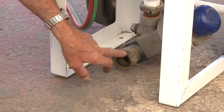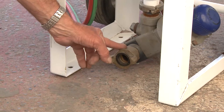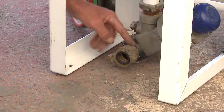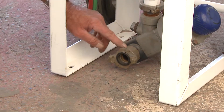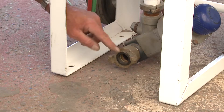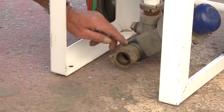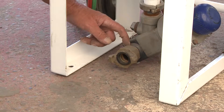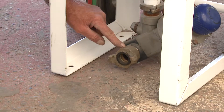On the end of the Thompson valve here we have a coupling — this is called a brass threaded coupling. The brass threaded coupling is normally put on with a bit of thread tape, primarily because we have to make sure that it's sealed. What can happen is if it's not sealed, the abrasive can mix with the air that escapes out where it's not sealed on the thread, and undermine the integrity of the thread and the coupling itself.